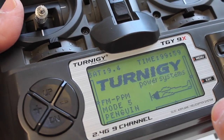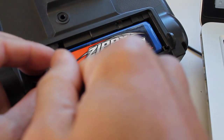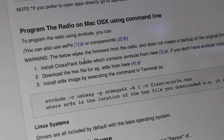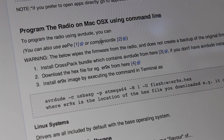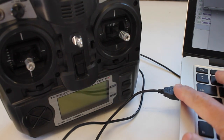Now let's dive into loading ER9X. We'll take off the battery case — our USB port is right here — and get that connected up to my MacBook. In the ER9X wiki you can see there's an ER9X firmware download, and I'm going to download the standard version for the 9X. I'll be sure to post all of these links in the description below. Now that we've downloaded the firmware, I'm on a Mac so I'm going to download Companion9X to install the firmware. You can use the command line, but for the sake of the demonstration it's easier to use Companion9X. I've downloaded it and now I'm going to fire it up.